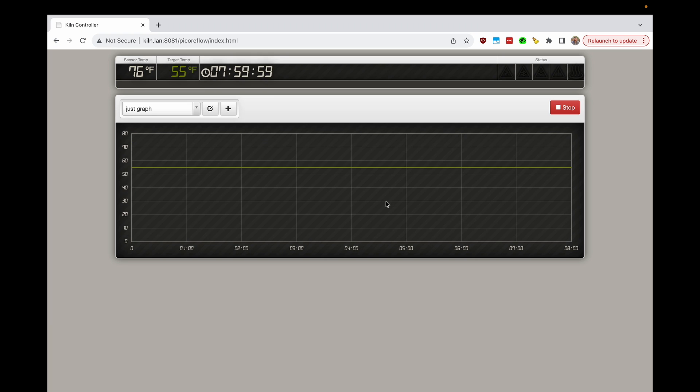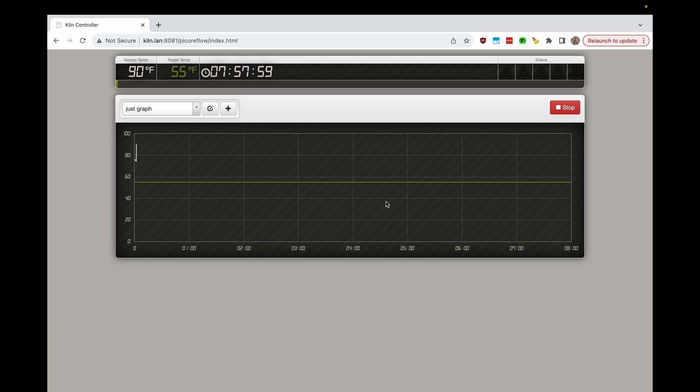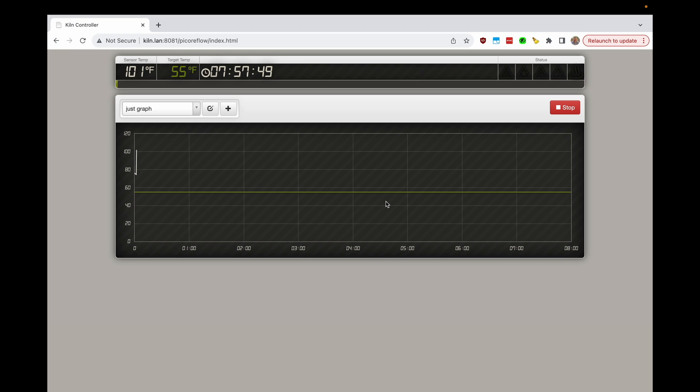I just swapped around the thermocouple legs — now it's reading 76 degrees, which seems a little bit better. I'll get my heat gun and use that to warm up the tip of the thermocouple. That's looking good — the temperature just jumped right up. Now if I let it run for a second it should slowly decay back down. With the heat removed, you can see the temperature is dropping. We have the polarity correct now and these temperatures make sense.